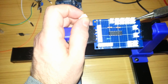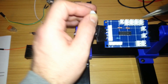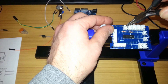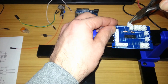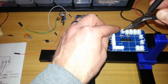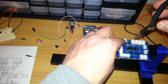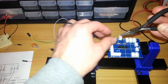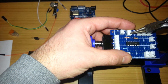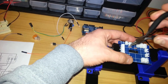So let's say this one right here — make that negative. Then I can just quickly run negative, negative, negative, negative. So then we're going to want negative there. I can have all negatives run along one side, and positives run along the other. So now I got a nice routing concept where all the signals on the inside are directly pointed at the mux — so this pin right here can be the one that runs to the mux. I've never done this before, so let's see what kind of trouble I can get into.